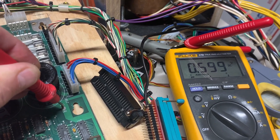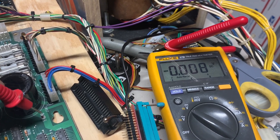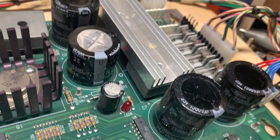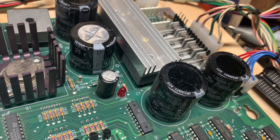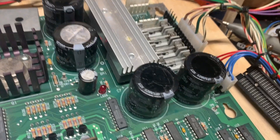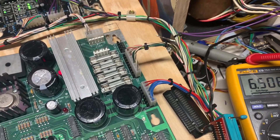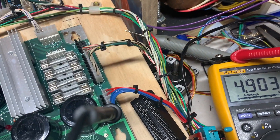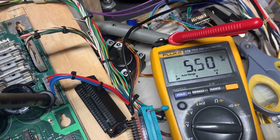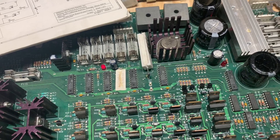Here I'm measuring test point 8, where there should be 18 volts of DC power. That gets regulated down to 12 volts by the 7812. The only thing that stands between this test point and 18 volts is bridge rectifier BR1, which is the bottom one on the dual heat sink configuration. The only other possibility was fuse F114, the lower fuse, and that is good. You can check AC power between that fuse and pin 7 of J101 — that's your AC power input that gets rectified at BR1, smoothed by C6 and C7 to create the 18 volts, then goes all the way across the board to the 7812 to get regulated down to 12 volts.